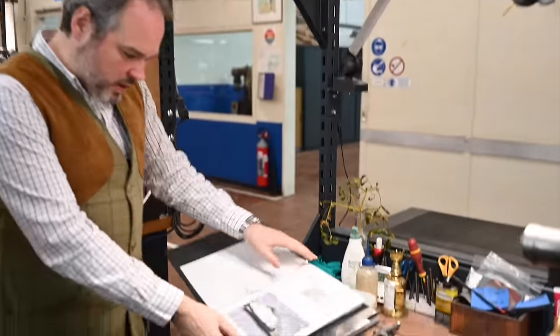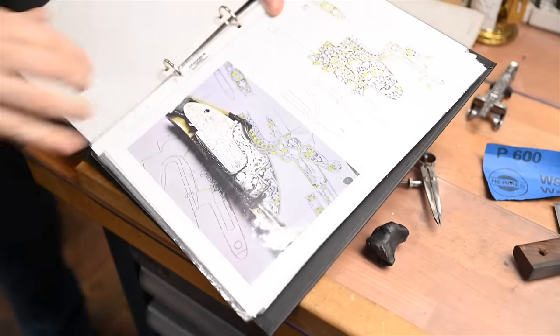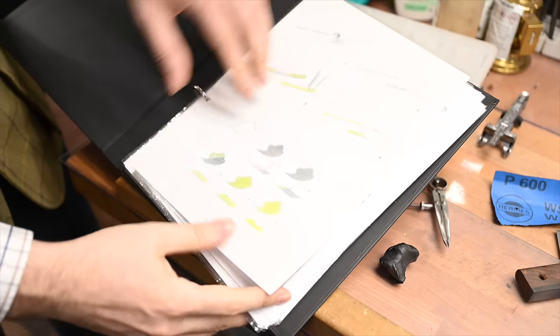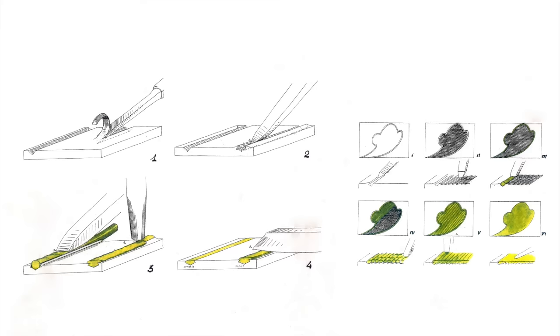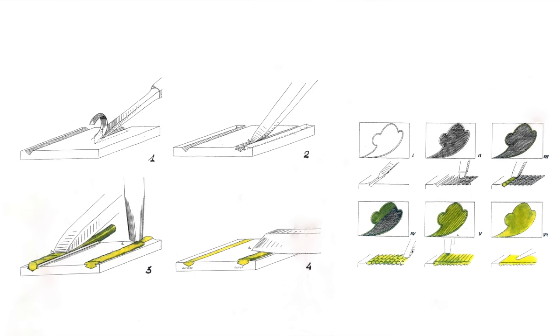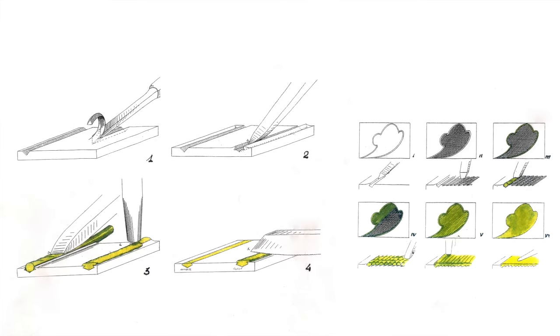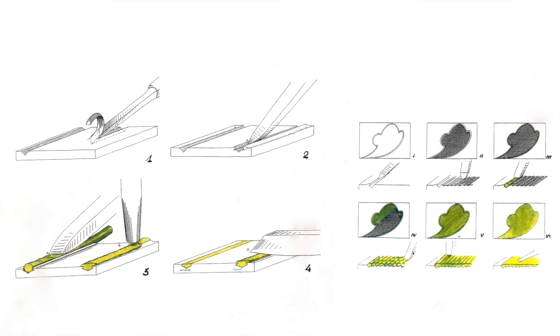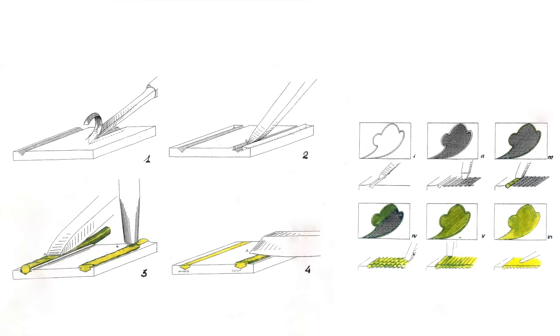So, that's a document showing how we made the special flower, the one you saw. So, you see all the design of gold and how does it work? First we do a line. When it's only to inlay one wire of gold, first we do a cut, and then we will do a cut under the surface. Then we will put the string of gold or other type of material. We will hammer it to make sure it goes under the surface. And then we cut the top. So that it's not glued or welded. It's mechanical. It's mechanically held under the surface of the steel.